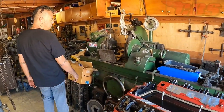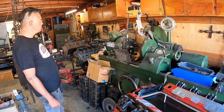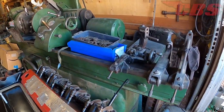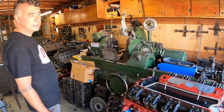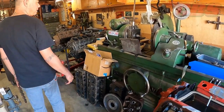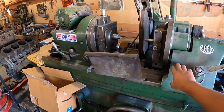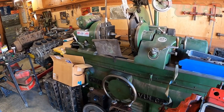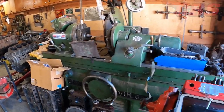This is a crankshaft grinder — we grind crankshafts. It's a beast. OD grinding up to about 74 inches in length and about six or seven inches in diameter. It'll grind tapered shafts. It has a 22-inch grinding wheel. He's had it about four years, and it weighs about 7,500 pounds. It seems massive — it is.